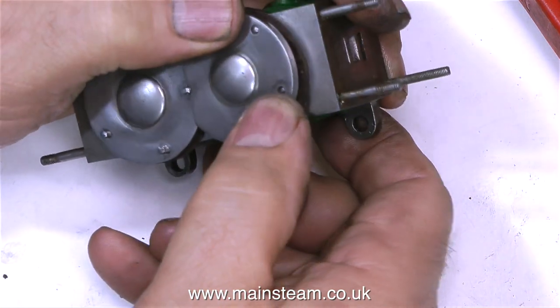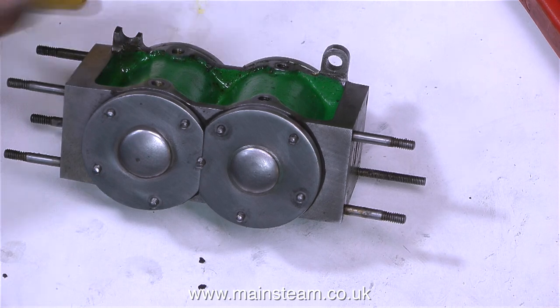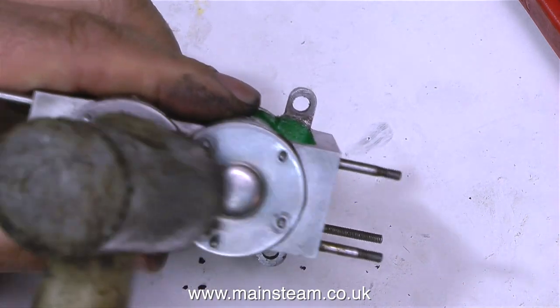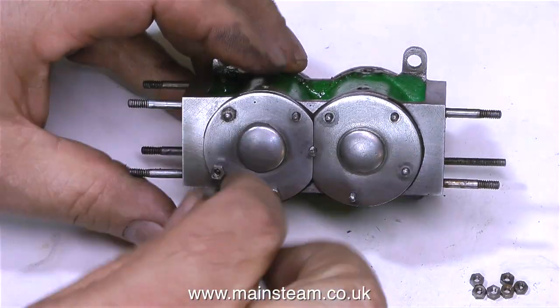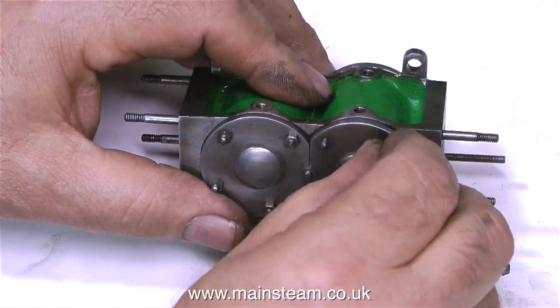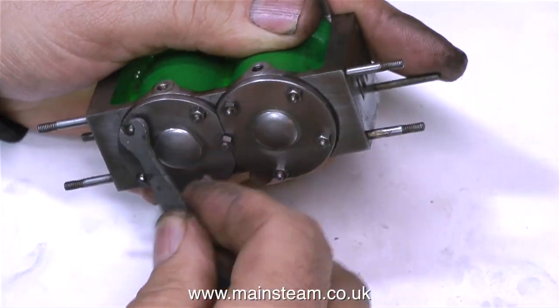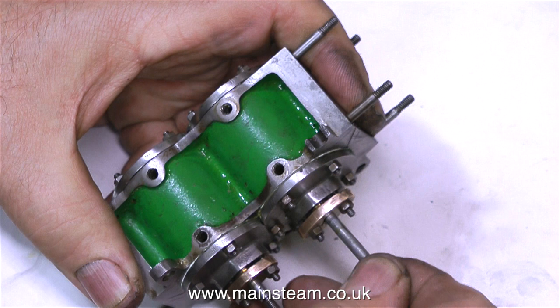So when the top cylinder covers are in place and held down with the small 7BA nuts, only you and I will know that two of the studs are not proper studs. Now that all the studs are tightened into the holes, the cylinder covers are quite a tight fit, so I'm just using my soft hammer to tap them into place. In exactly the same way as I fitted the nuts to the lower cylinder covers, I fit all the nuts to the studs to hold the upper cylinder covers in place — very careful not to shear any of the studs. And that's it for this episode — the cylinder block is back together. Both pistons are in with the cast iron piston rings, the glands are in and the gland packings. Thanks for watching and I hope you found it useful.